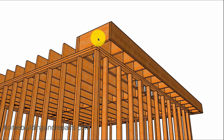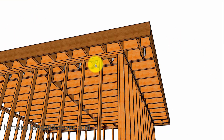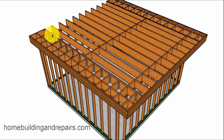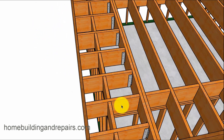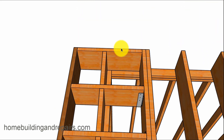Since this was going to be a non-load-bearing support out here, I just switched the direction on the joists around the perimeter and we have hangers here supporting it. The long joists here are supporting this cantilever, and then over here, the support is coming from the cantilever joist on the opposite side. We could have a little weak spot here — this is always a problem area for structural engineers. Keep that in mind: it's going to be the weakest part of this structure, until we get to the last example in the video.